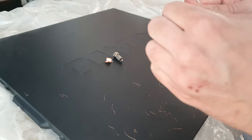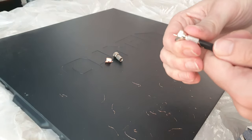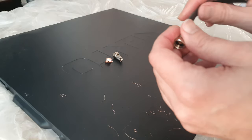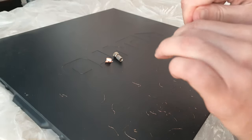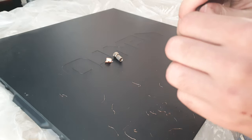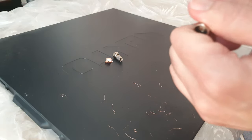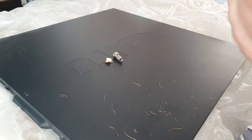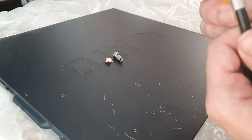This is a WF100 cable by Webro. I've also got the WF125 and the WF165 — that's a great cable and recommended, but not for this sort of job. It's more for long runs and commercial use. I did use it on a satellite dish and got really great signal with no signal loss, but the problem was it wasn't very flexible, so I ended up changing it to the WF100 because it's the most flexible cable and best quality you can easily get hold of. You can also get HD100 but the quality difference is marginal.